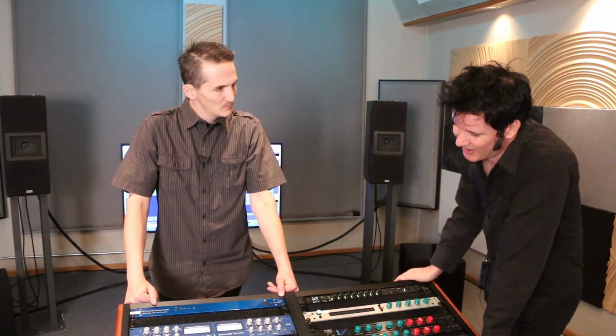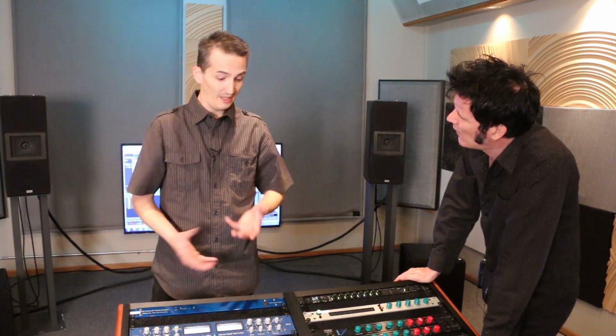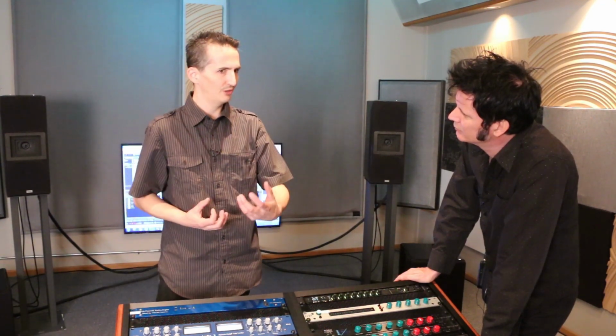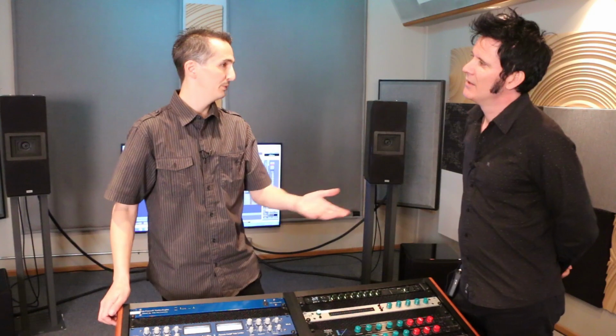Why do you think they did that? Because there's certain frequencies that, I don't know, musical? Well, it is that. They're helping you make decisions. Yeah, and that's the idea behind it, and a lot of times stepped frequencies on an EQ, analog at least, that's the exact thing, is that each one uses a different set of resistors or capacitors to do what it's doing. So yeah, I think this being a completely passive EQ, like a Pultec, it's a passive EQ.